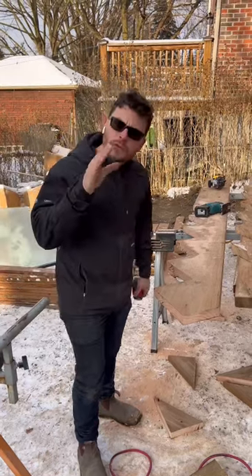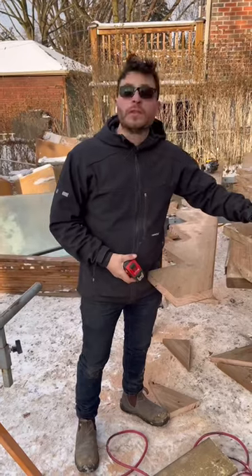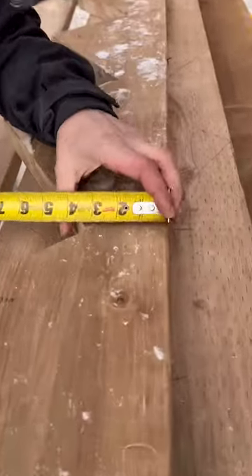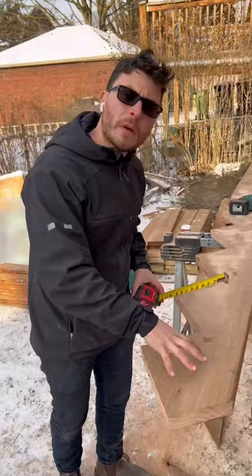It's time for part two on those really terrible stringers I posted yesterday. A lot of you were saying that the throat on those two by ten stringers looks like three and a half inches. Well, come in here and check this out. That's a three inch throat with an overcut — that's not deep enough. We use a two by twelve.